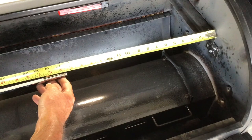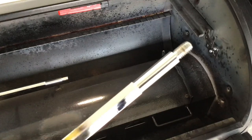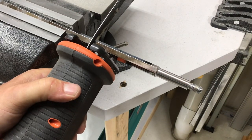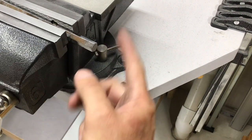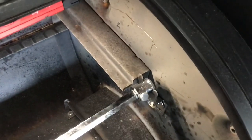Here's the nervous moment - you only get one shot to get this right. I want the spit to extend over that far bracket by about half an inch, then measured right to where the threads end. We're looking at right around 17 inches as the cut point. I measured again to make sure because if it's long that's okay, but if it's short, not so good. I cut it at 17 inches. The original thumbscrew was going to be too long so I had to grind that down as well.